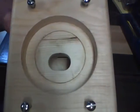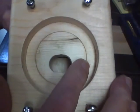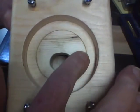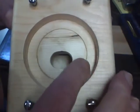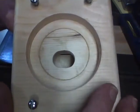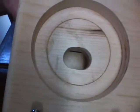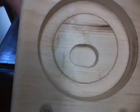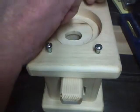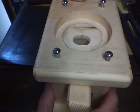Okay, with the top on, I cut a circle here with a 2 1/4 inch hole saw and used the blank, which is about 2 inches, with a little sanding, and then I cut the opening in that and glued this to the top. Now looking inside, you can see the action there. And that just about completes the build, except for adding the bottle and the finish.